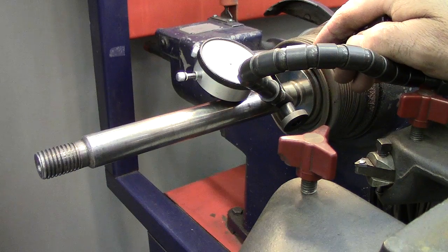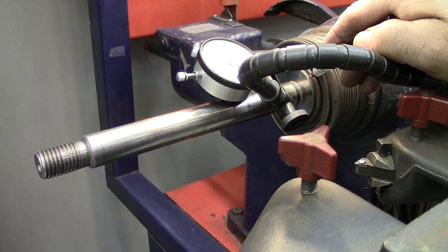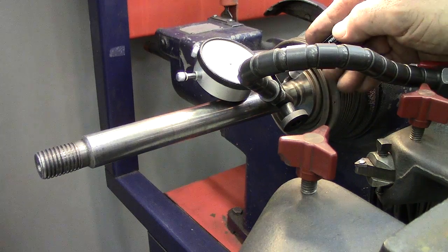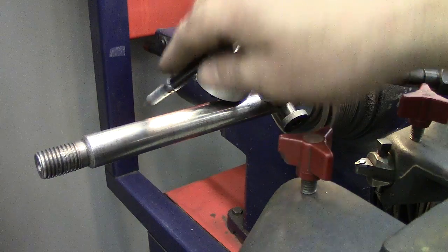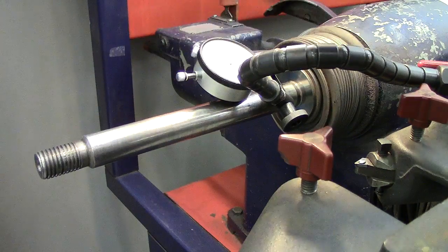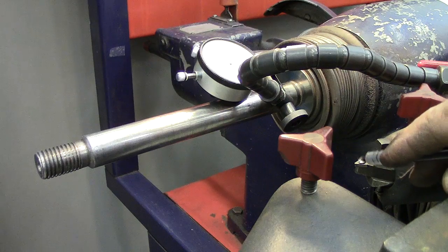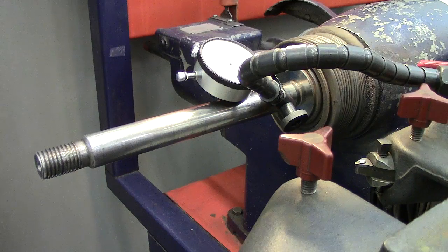Of course, I have this flat surface on this back side that everything's going to slide back against. That's going to be the flange. Then, of course, the armature itself, the arbor itself, the whole way out needs to be true on its axis. If it has any up or down, your rotor is going to go up and down and not work right against the cutter, giving us an uneven path that could cause more brake wobble. In fact, I've taken rotors and had them turned and got back twice as much wobble as I had before by the people not chucking them up properly on these.